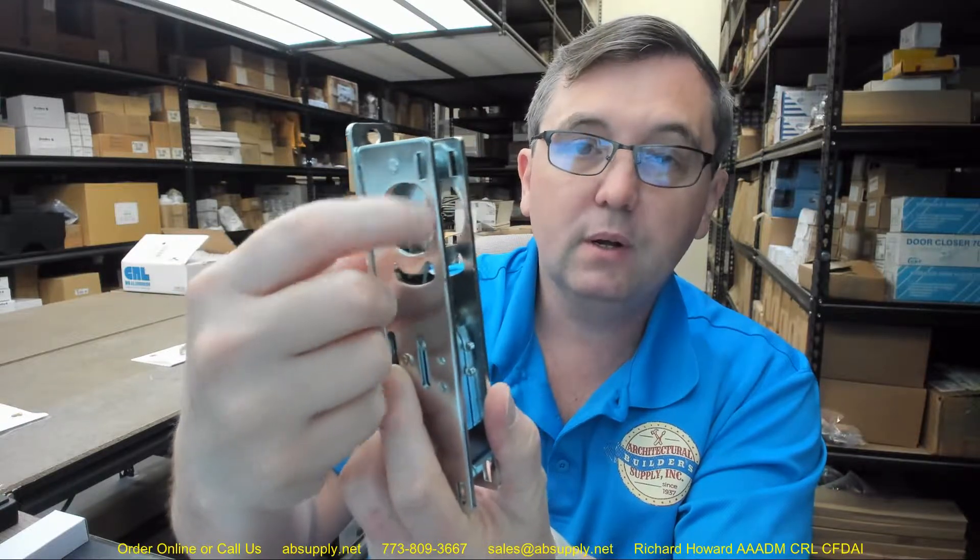For a steel door application, I've actually sold these in hollow metal doors that we've turned into literally access panels — 18-gauge hollow metal doors, just three foot by three foot — and they work fine. The issue is you've got to be able to place your strike accordingly, especially your center line. A couple of screws here is what's going to hold your threaded mortise cylinder, thumb turn, and things of that nature.